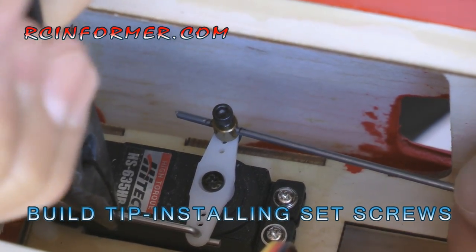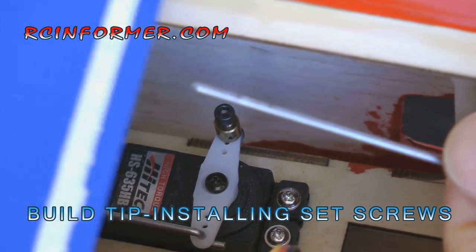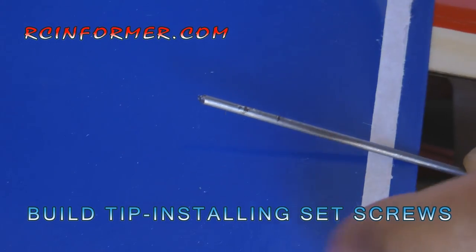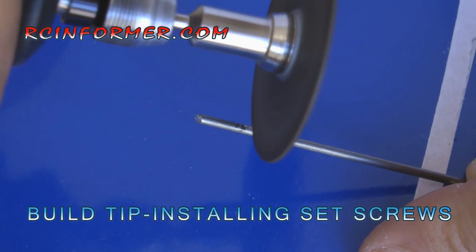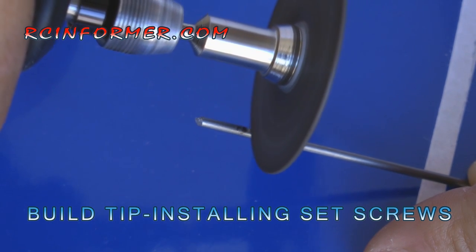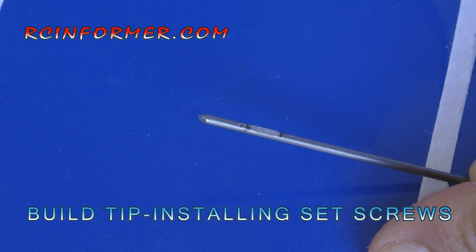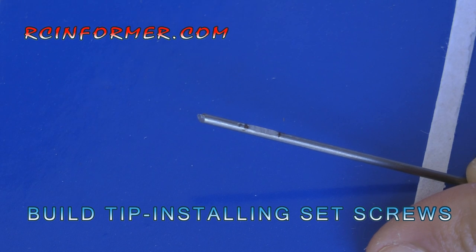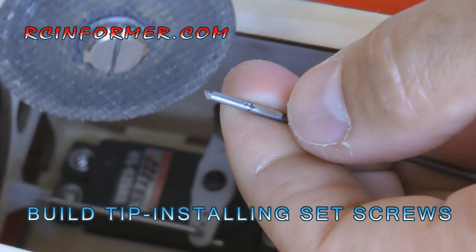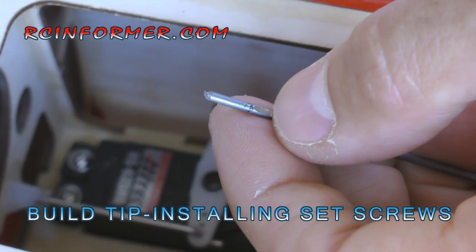Remove the rod, and then you're ready to cut your flat spot. Pull this up out of here, put a piece of cardboard under it, and take your Dremel to file a flat spot in there. There we go — there's a nice flat spot. I made it a little wider or longer than it really needed to be in case I need to adjust it, so I have a little extra room. I'll also round this edge here — it's pretty sharp because I cut it with a pair of diagonal cutters — so it'll fit back into the hole of the EZ connector better.